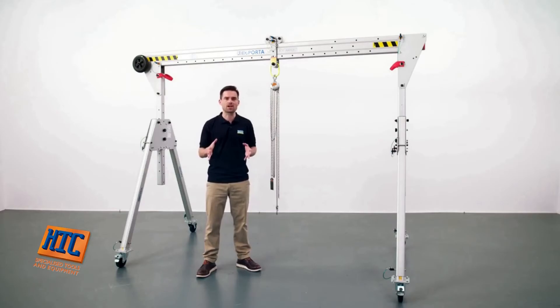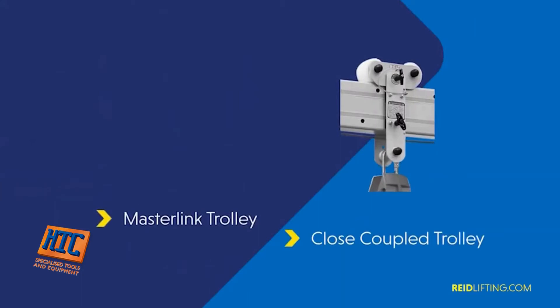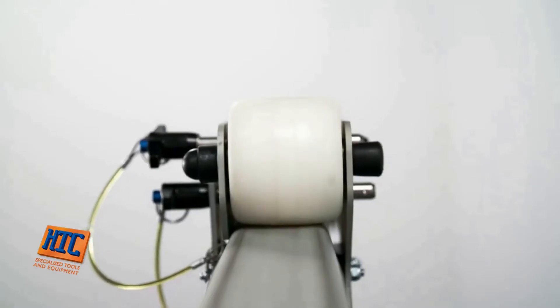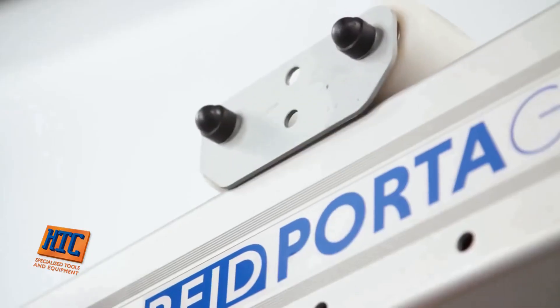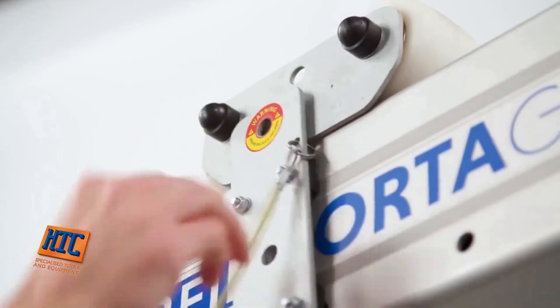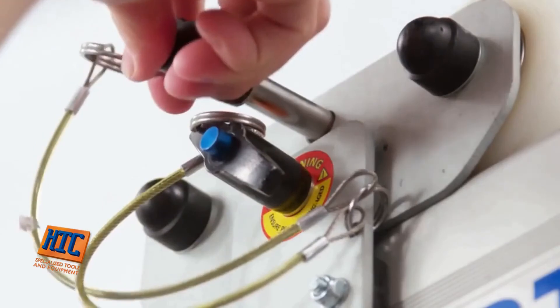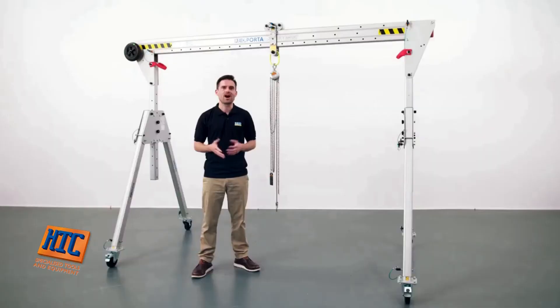If you need a maximum height of lift, our patented gated trolleys are available in a close-coupled version, or alternatively a masterlink version if you prefer the convenience of a larger opening for a variety of hoist or fall protection devices. Our gated close-coupled trolleys can be used when additional headroom or clearance is needed below the beam. Our gated masterlink trolley can be used when additional headroom or clearance is not an issue. Our innovative gated trolleys enable more than one to be attached to the beam after the system has been fully assembled.